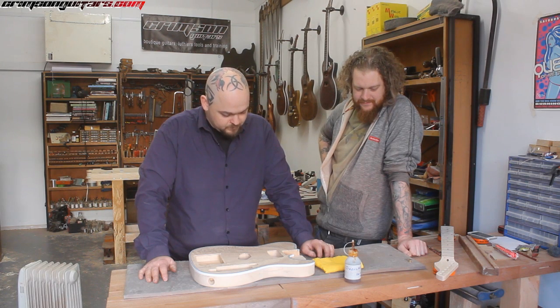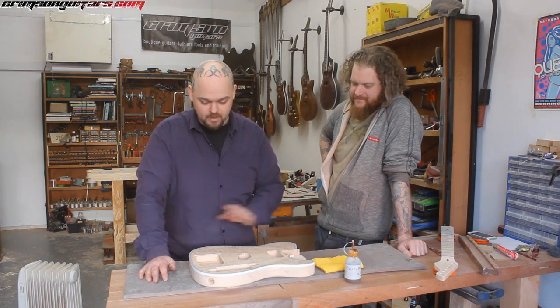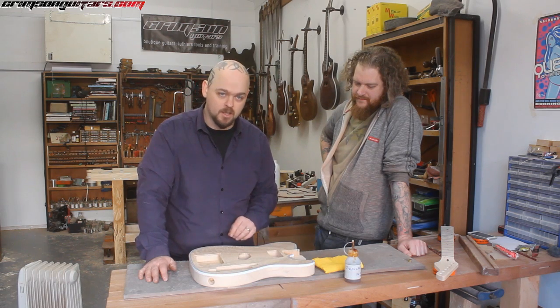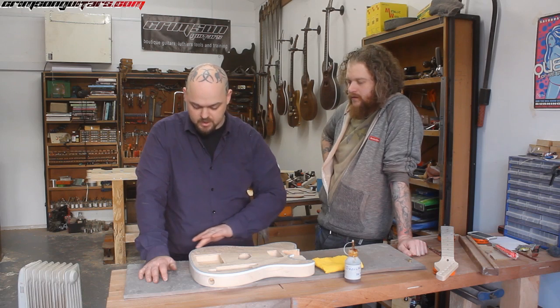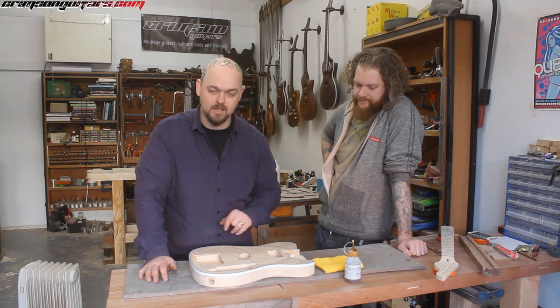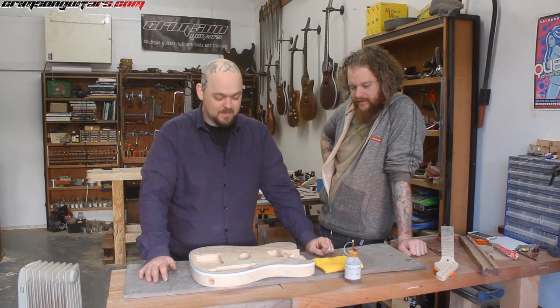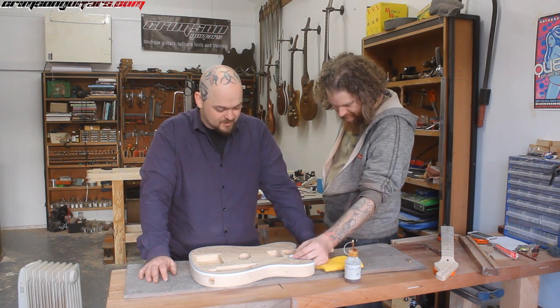However, Howard, he sanded down this whole thing. It's almost perfect. I've just noticed one last thing he needs to do, which is round over the edges of the binding a little bit and scrape the binding clean with a scalpel. We mentioned that like 4 days ago. We did. And I haven't actually got to doing it. Well, we're at that stage now, so that's good.